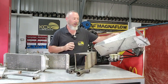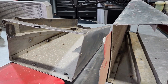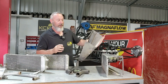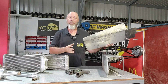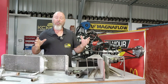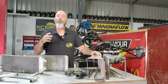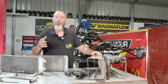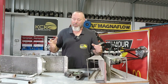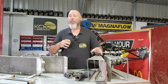These have had quite a hard life. I don't remember them being this bad when we had the car. The top's been bent in and smashed flat with a hammer. All of them are broken and I really don't think there's anything usable in either of these. These mount the nylon skid plates on the very outside of the car so they flex themselves. They're allowed to move up and down — so if the driver runs over a curb or hits something on the track, there's a little bit of give. The bodywork will flex — it's only fiberglass — and it allows these to move in the side pods without breaking anything off.